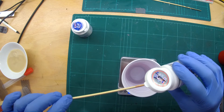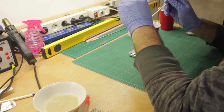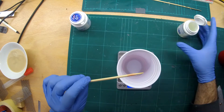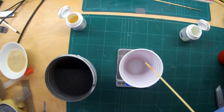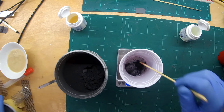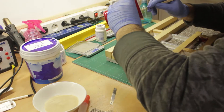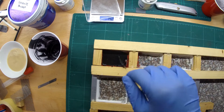I'm using a 2-part epoxy for the binder, which has a ratio of 1.78 to 1 resin to hardener. For the first friction test block, I began by preparing a resin-only formulation with 5% graphite powder as a potential lubricant. This was applied to the bottom of the mold, over which the epoxy granite mix will be poured.